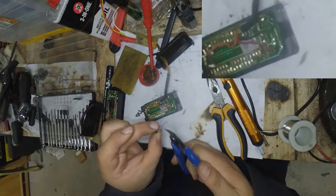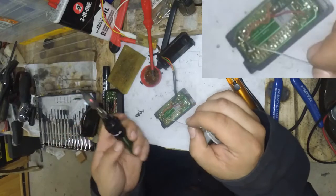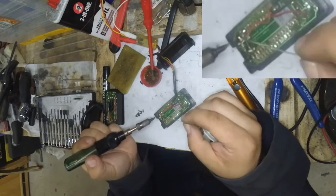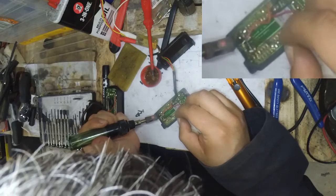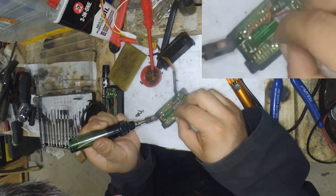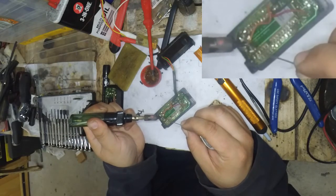So there we are — the direction is this, so I just need to bend it, cut the tips, make things work, and reflow. And we're on to try this again. There we go — clean connection. Come on, finish off that burning — should be just hot enough now. That looks like a good solder joint. Now I'm just going to tin this wire and then connect it on the top.